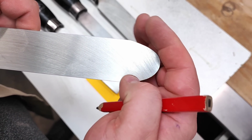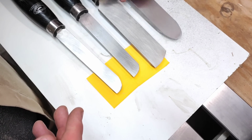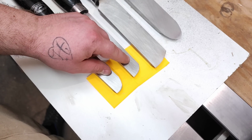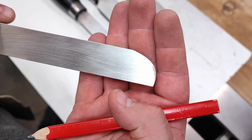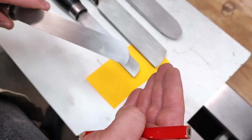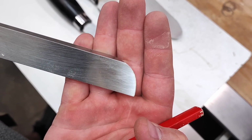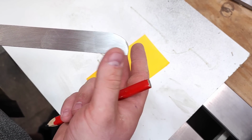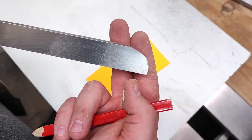or smaller bowls, sorry, I have this sort of profile that works really well. Although this one doesn't get used all that much, usually for any bowls that I do, these two work really nicely. So just to show you real quick one more time, this is that with a little bit tighter curve and slightly asymmetric curve, and this one with a slightly shallower curve here. Can be used also, and the other bowl scraper can be used on end grain work as well. Nothing stopping you. I just call these bowl scrapers because I use them primarily for bowls.